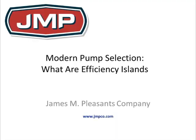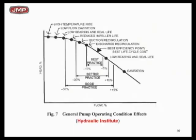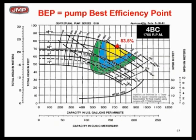So what's the pump selection guidance? From ASHRAE and HI — both have some best practice comments. HI, which everybody belongs to, is pretty much around BEP, and they would caution you to go a little left of BEP. Here's the best efficiency pump curve idea — this one's 83.5%. Everything in yellow would have an efficiency island equal to 83% or higher. Jumping down to the green, everything in green would have an efficiency island equal to 80% or higher.